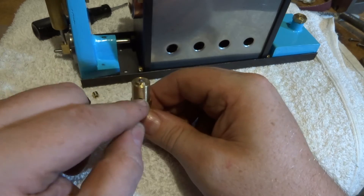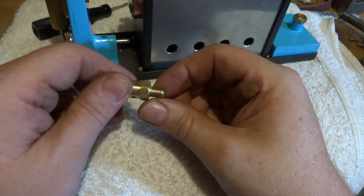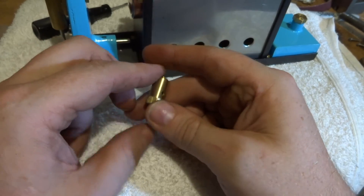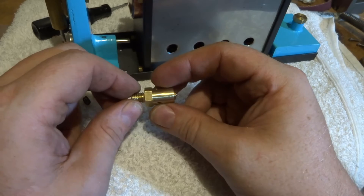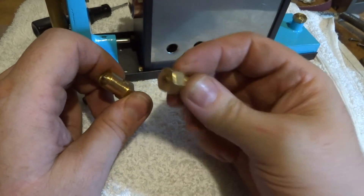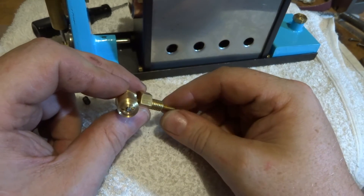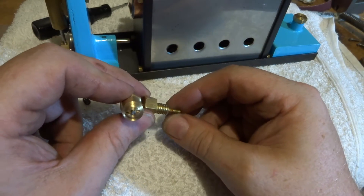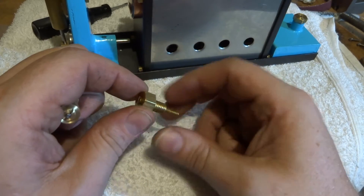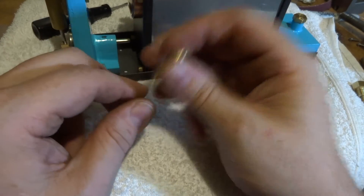When the ball pops, this piece pokes up and the steam comes out here. To me that looks like a pretty good little thing. It's nice and steam tight for a start, which the other one certainly isn't and can't possibly be by its nature. If it is steam tight then it's not going to go bang, it's not going to blow.